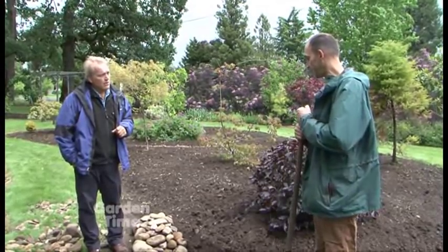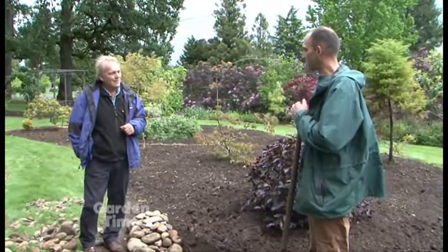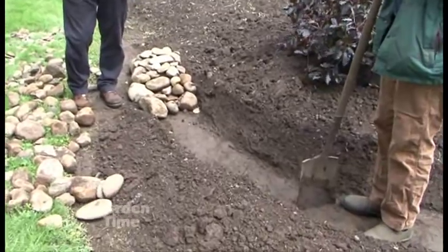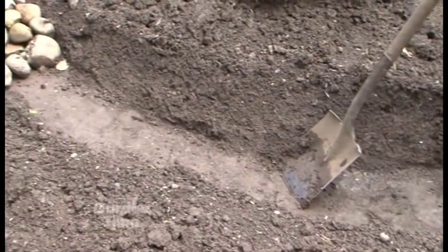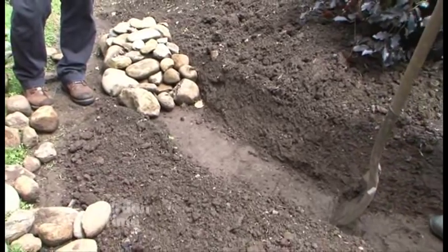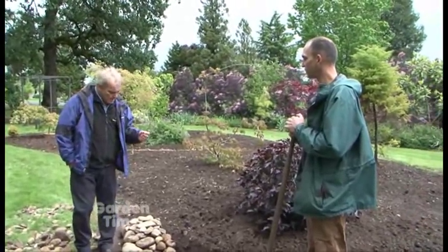It was kind of trial and error. I started stacking them up — I've got enough engineering training to know that I needed to give it some width, support it, and have it stay in place. I see that you've started it here and you have a very flat surface carved out with a flat shovel. Yeah, to get started I just take a flat shovel and dig out the soft soils, get myself down to where you're into more compacted soils as a good solid base. These ones again are not structural, so I'm not too worried if they settle and shift a little bit — since they're not concreted in at all, it's just gravity that holds them. If they do change, you can always go back and adjust them. Absolutely.